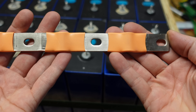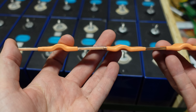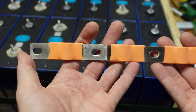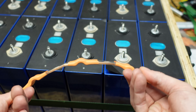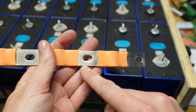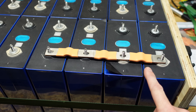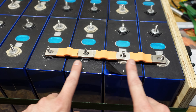They also make a version of this bus bar with four terminals on it. This is perfect for a 2P16S configuration where you need to connect two cells in parallel and then series those batches of two. It's super flexible because it's 30 layers of material, compressed at the terminal points so it doesn't flex them. You simply set this down on the four cells you want to wire in parallel — these two are in parallel, these two are in parallel, and then the whole thing is wired in series.